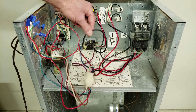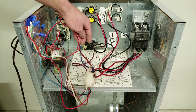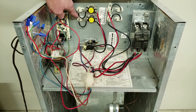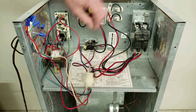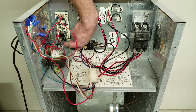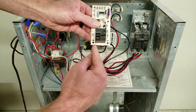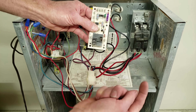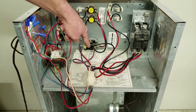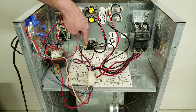One wire is connected to one contact coming from your breaker — one of the two 120-volt legs for your blower motor. If those contacts are together, a black wire goes up to your thermal limit and over to your electric resistance strip heater, powering the bottom electric strip heater. Another wire goes through the connector to the bottom of a small block. That contact is normally closed, and your common is typically where your blower motor wire is connected. So if those two are closed and you have 120 volts because the contacts are welded together, your blower motor and electric resistance will both be running.